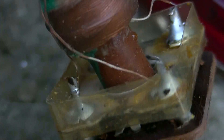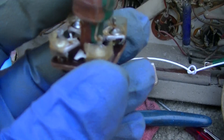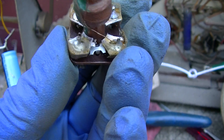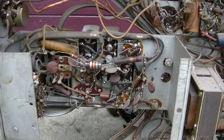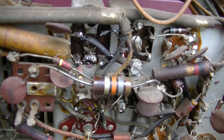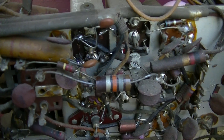It was arcing across between the two mica capacitors, so I just cut them all out with a pair of dykes — they're gone. I tacked a couple of 110 picofarads on the bottom but they were way off because I ended up screwing the trimmer core adjustment all the way in. Then I tacked a couple of 120s across there.